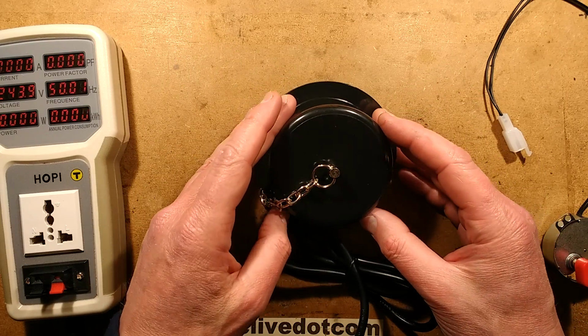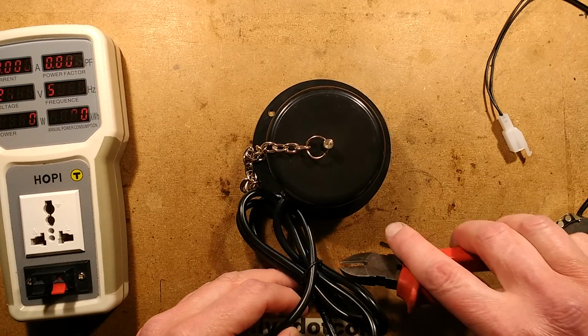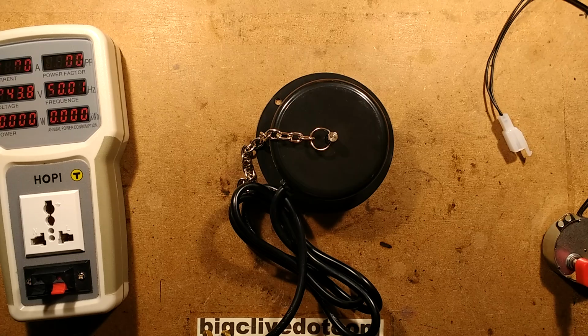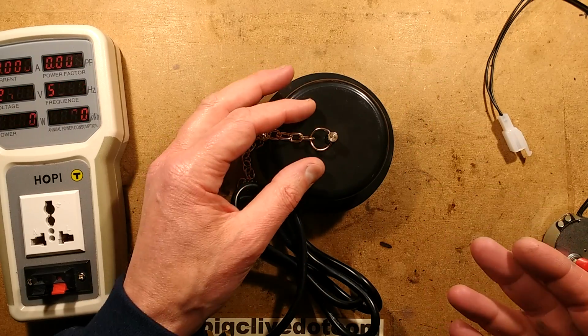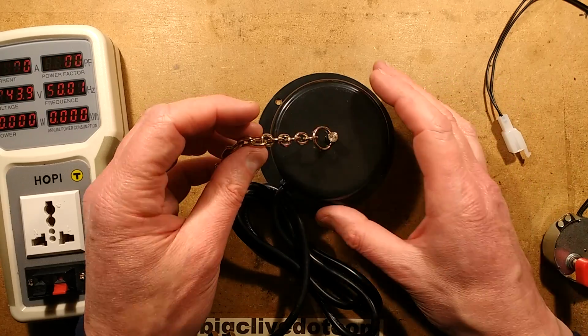Let's take a look at a mirrorball rotator, and this is arguably one of the earliest disco lighting effects. It's very simple. It's just a synchronous geared motor, designed to rotate a polystyrene moulded or fiberglass ball covered in pieces of mirror. When you project a fairly focused beam at it, it scatters the light everywhere. It's the classic ballroom effect.